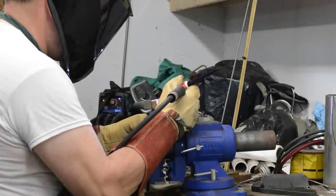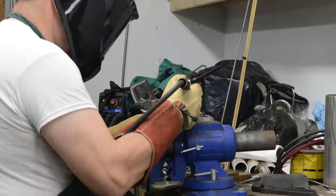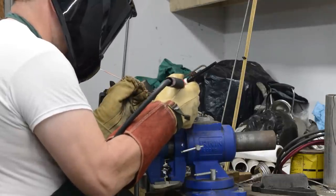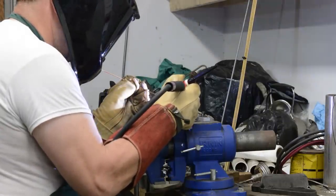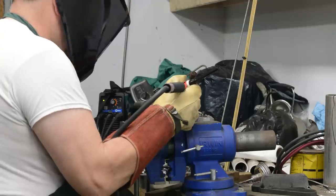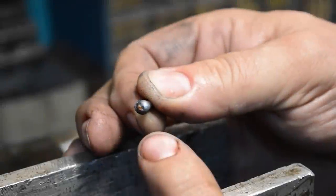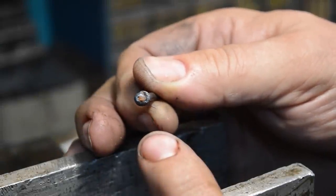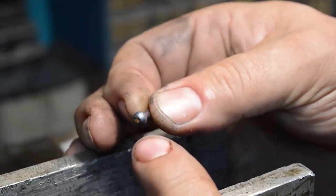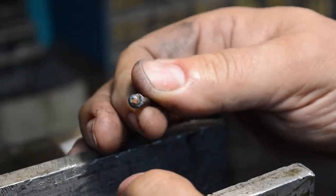All right, so we're up on top of the vise here back by my casting and hot workstation, and we're just going to weld with a TIG welder. We're going to weld a piece of rod down inside that hole that we shaped, and it looks like this. So all I did was weld a blob of metal up on top of this screw in order to fill in all the stuff that was missing. Now we'll go over the grinder and just grind that around on a corner like that, grind it off flat, cut a new slot in it, and we're fat.